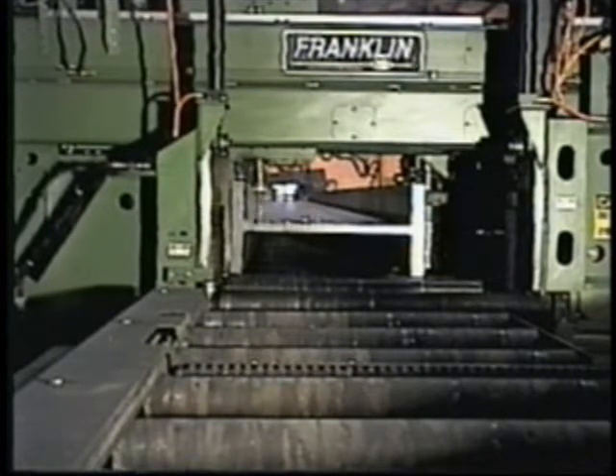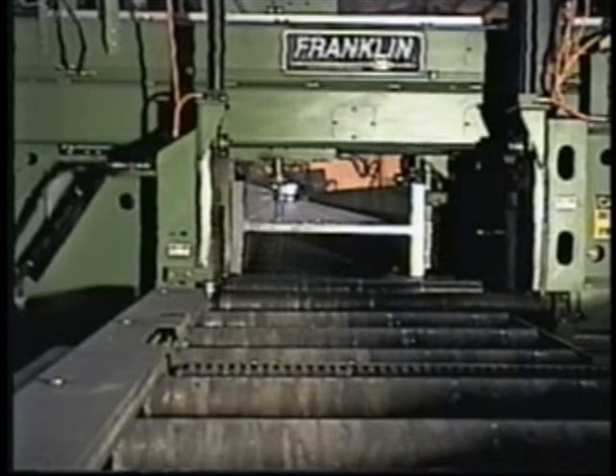The Franklin HD 145 aggressively drills heavy structural shapes, made possible by several key engineered features: the ability to run carbide and super cobalt tooling, advanced spindle drives that monitor torque and RPM, and a true hydraulic servo drill feed rate that provides zero breakthrough comparable to ball screw type feed, while still providing all the advantages of hydraulic drill point detection and drill length calibration.